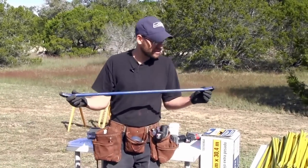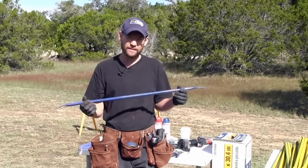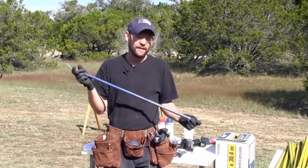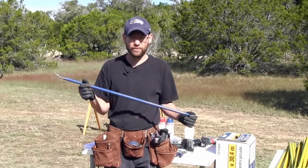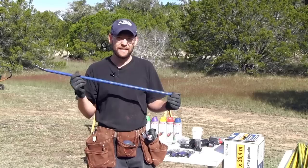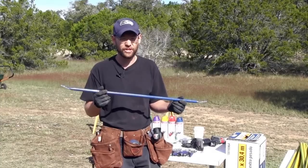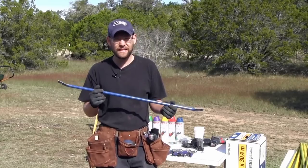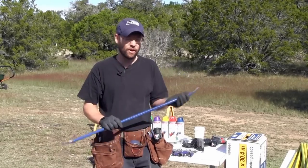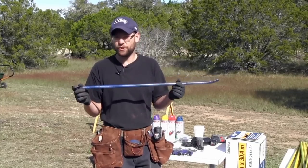Now when it comes to struts, there's a couple of things that matter: the length, the angle that's bent on it, and the coating. What we're using is half-inch steel electrical conduit. As far as price comparison goes, this is actually cheaper than PVC. And you don't want to use PVC for a couple of reasons. First, it degrades in the sun, so the longevity of your structure will be greatly decreased — they'll probably only last three to five years. PVC becomes brittle in the sun, and PVC interacts with plastic, so the plastic sheeting you put on will get eaten by the PVC over time. There are ways around that — you can tape the PVC — but metal conduit is absolutely the way to go. This one will be standing 20, 30, 40 years from now.